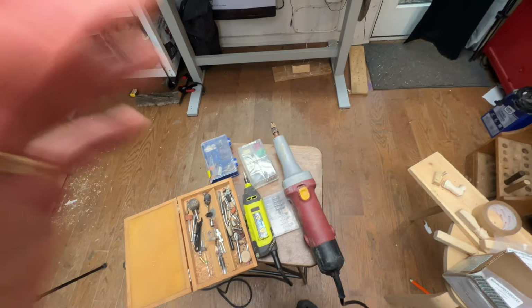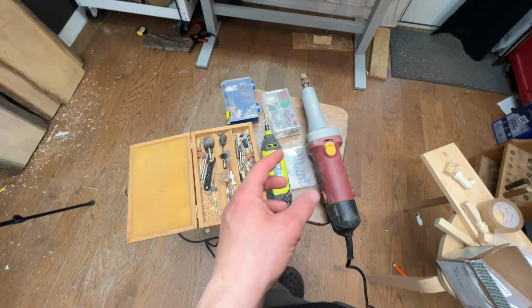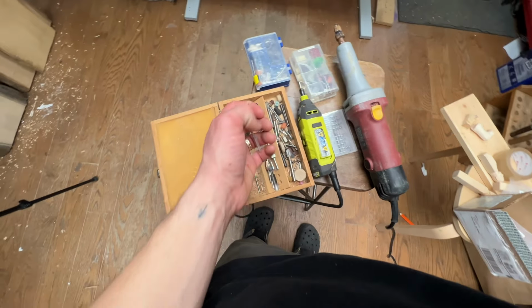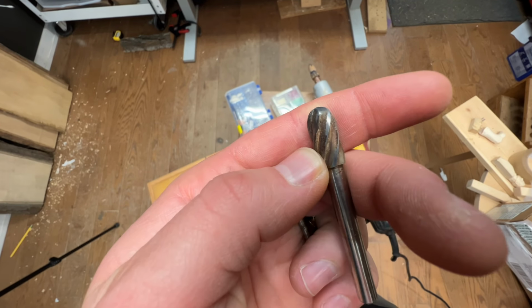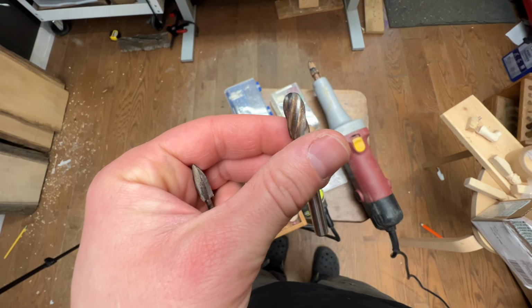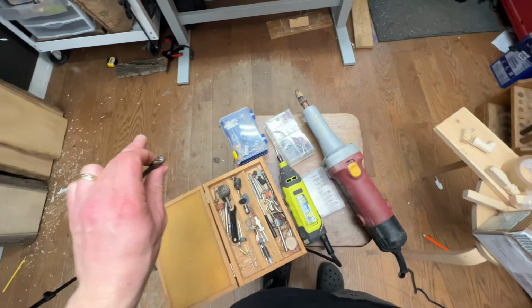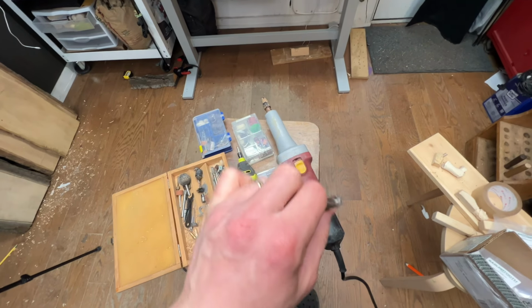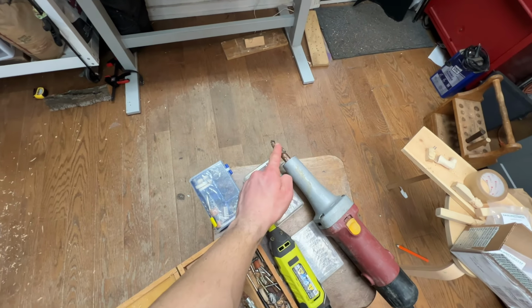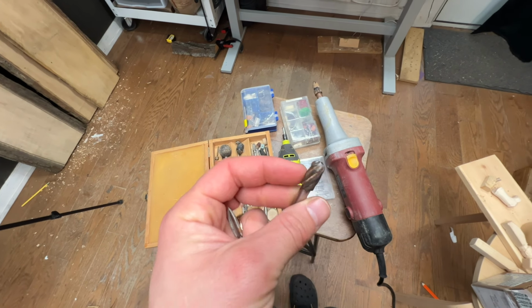The second type of burr that I use most frequently is called the single cut carbide burr. Typically they're carbide. Single cut means they have one parallel line after another running throughout the tool. Some of them are very coarse and cut more aggressively, remove more stock, and are therefore harder to control. As far as safety is concerned, these more coarse bits, basically across the board, with the exception of our final contestant, which you can stick around in this video to find out about, which offers the most control, these coarser bits, the single cut and the spiky type burrs, both really grab onto the wood and they want to pull. So you really have to hold on to the tool in order to keep it on track and control it.